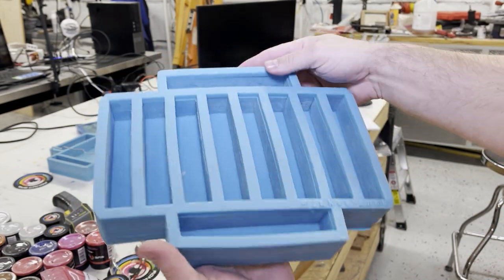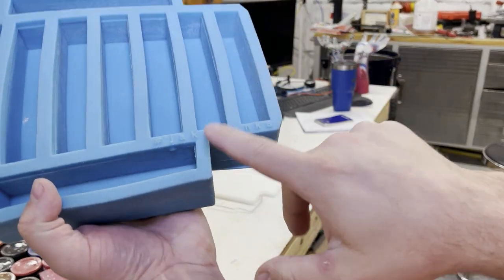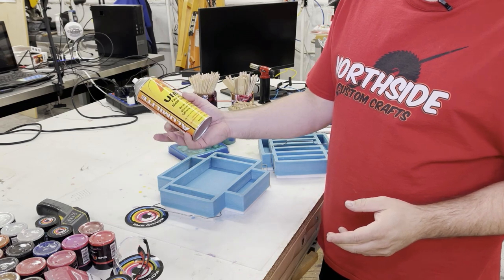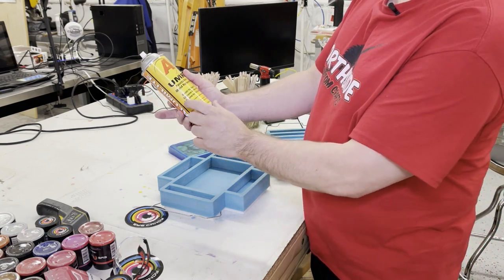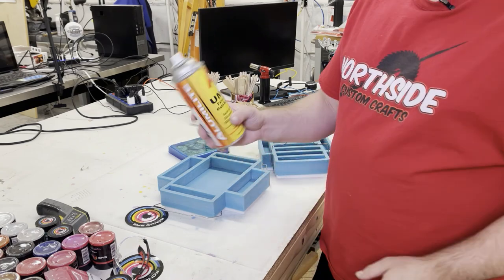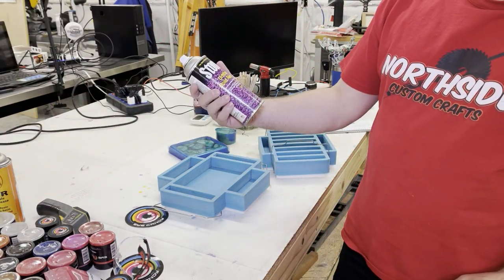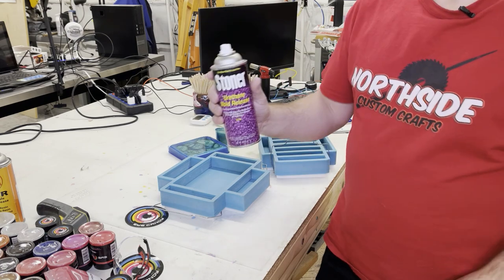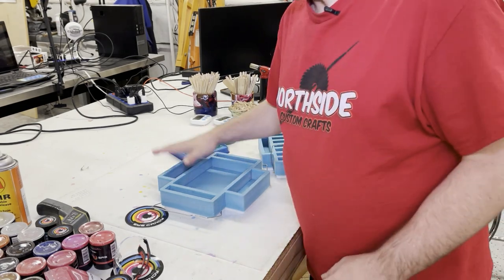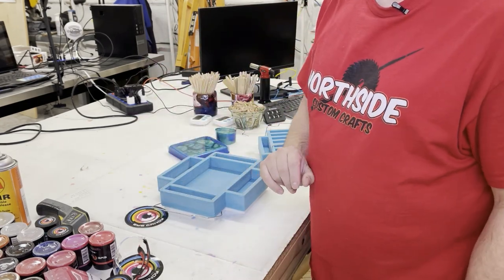I have the molds full of rice. I'll fill each one up to the line — we did create a line when we made the form. Dump it all into a big bucket, put it in the measuring container, and we'll know how much resin we need. I'll have these filled to about 32 ounces. I'll put on the UMR mold release — it's resin-to-resin, silicone-to-resin, silicone-to-silicone. I highly recommend using this any time you're doing mold making or casting. I'll get the resin divvied up and we'll come back when I'm ready to pour.